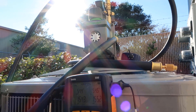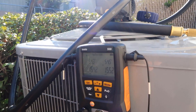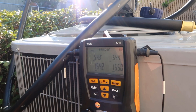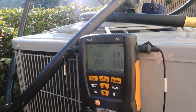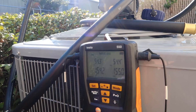154.3 on the suction is what I'm primarily going to watch. There'll be a little bit of equalization and fluctuation with temperature, but it should stay right in that zone. We're going to let that hold for a while — the standing pressure test — then bubble test the actual threaded connections and see what we get.